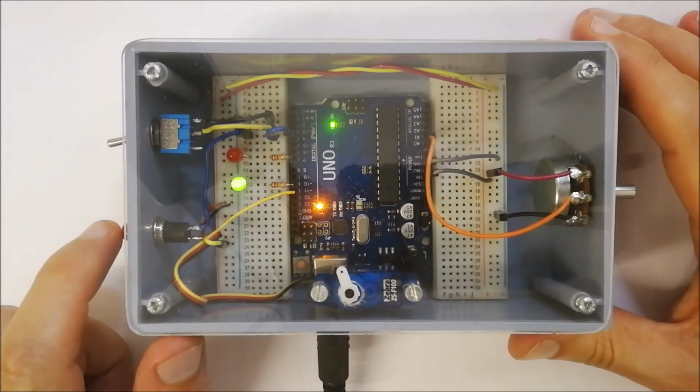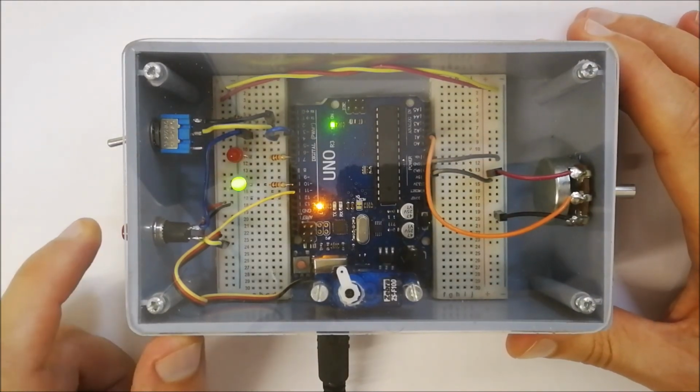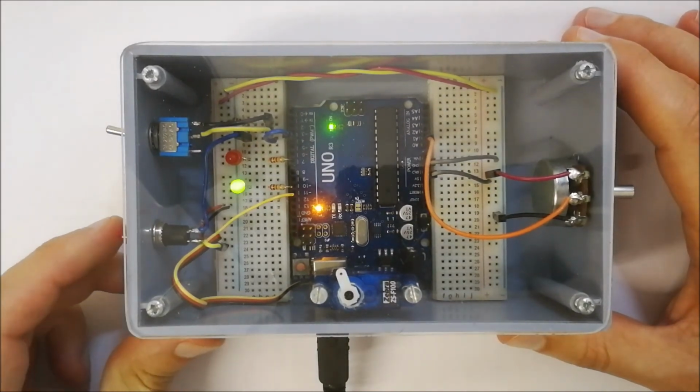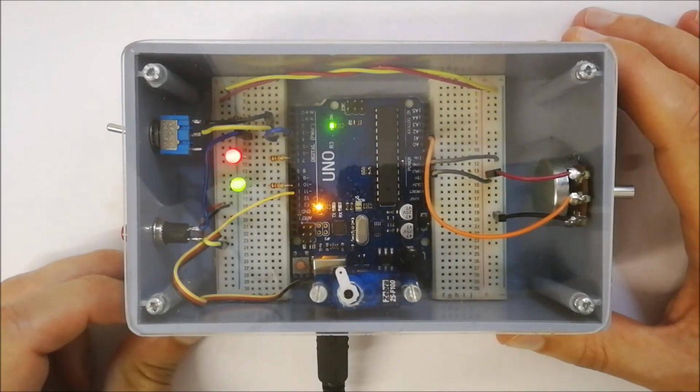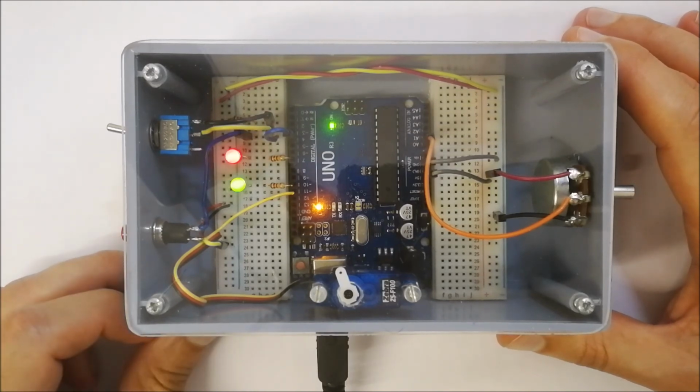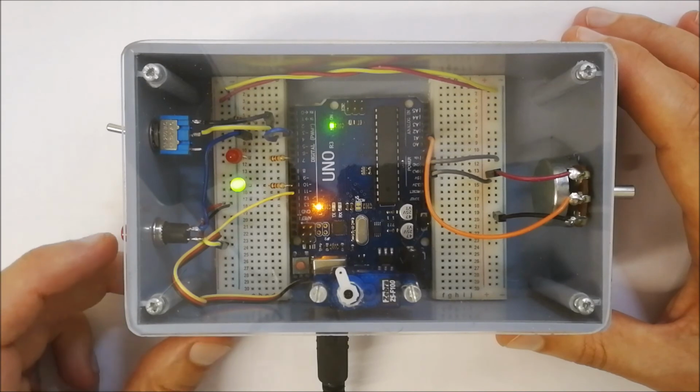If we push on this button, you'll see the LED switching on and off, the red button over there. I've pushed it, the LED stays on, now it's flashing and goes off. That's because of the charge on that specific pin. Whenever I push it, my controller doesn't know, okay, well, I'm still seeing the charge on that pin, should I switch on, should I not? And then as it discharges, it gets to a point where it doesn't know if it's now in the on state or off state, and that's where it flashes.